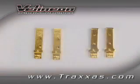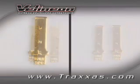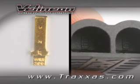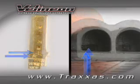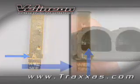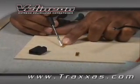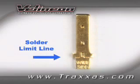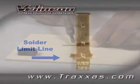It is very important to make sure that you have the correct terminal to solder. Here we're soldering the female terminal that will later be installed into the female housing, both labeled with the letter B. The male housing is labeled with the letter A. Notice the side of the terminal that is labeled with the words wire side. This is the side of the terminal you will solder to. Make sure no portion of the wire or solder is past the solder limit line.